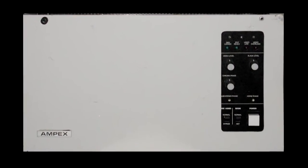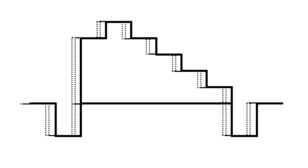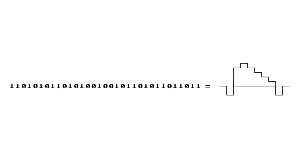This is how much time-base error is actually in a home VHS machine — pretty nasty. So to play back helical scan VTRs in a broadcast environment, we still needed a time-base corrector. Here's an early one. It took up a large amount of space in an equipment rack and couldn't even correct a full field of video — it could only store a few lines of video in computer memory. But it worked. It took the original shaky video, stored it in memory, and then played out those few lines in perfect synchronization, so that the rest of the broadcast equipment could use the now-stable video.